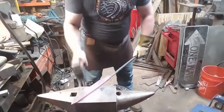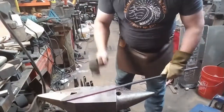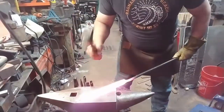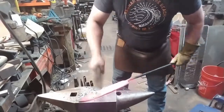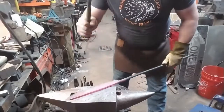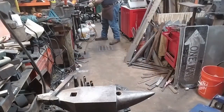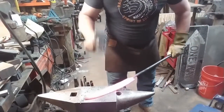Ultimately, if you have a seam that fails, the best thing to do is to cut it off and work with a smaller billet. And that's exactly what I wind up doing. I think I do that off screen, but I'll be chasing this seam around for a little while. I think here I've just cut it off. And it behaves nicely for the rest of the build process. I lost about half an inch. But that's okay. We have plenty of metal to deal with. We'll have a very nice, healthy sized blade.